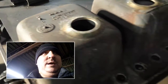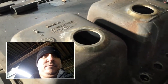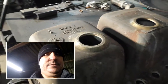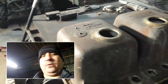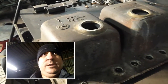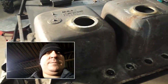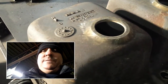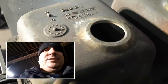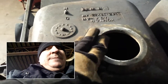Typically this would be something you'd bury in sand to keep it from losing heat too fast. I just don't have anything to put this in with enough sand. Maybe in the future I'll build a sandbox basically, here in the corner of the shop, fill it up with play sand specifically for cast iron work — because ideally you would just bury it. I'm not going to be too concerned with that this time since this is not structural by any stretch of the imagination. I just need it to be able to cover this hole.